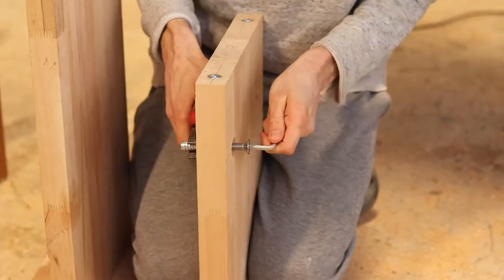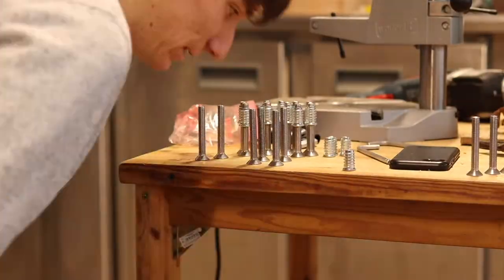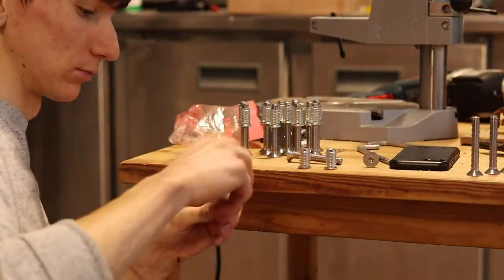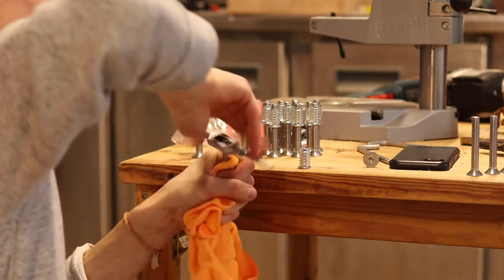So to get the screws out, I had to grab the inserts with pliers and slowly work them out. With all this jamming action, the threads for a lot of the inserts were freaked up, so I went through and cleaned them up with a tap. Captain Crunch, anyone?